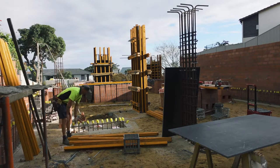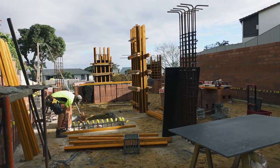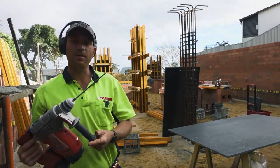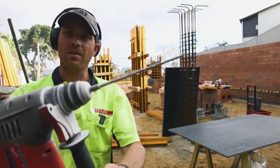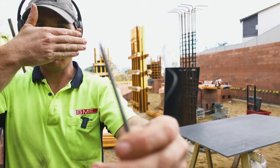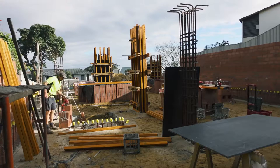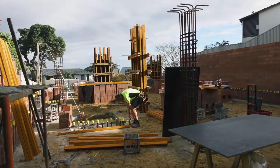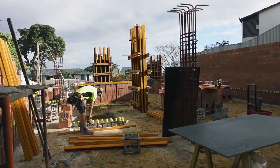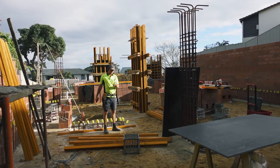First I'm going to put my kicker down at the bottom of the timber. To fix these down, we use a 6.5mm masonry bit, and then a tech screw and wire. As you screw in, the wire wraps around and widens.